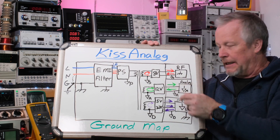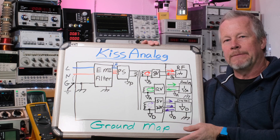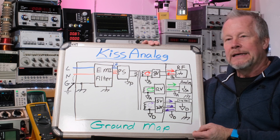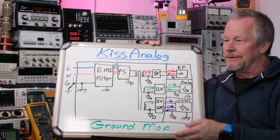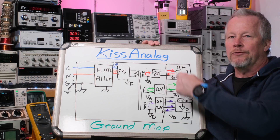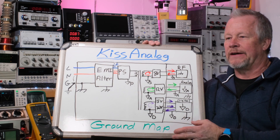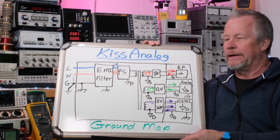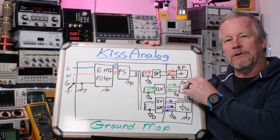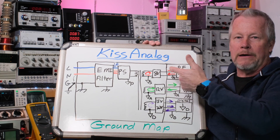If you set a temperature sensor up on the RF circuit and you're reading it down on the digital card, that line crossing over all this stuff creates considerations you have to be careful about. Temperature sensors that tie to the chassis can be problems because you're actually taking current from chassis and flowing it down so you can read it. Always be careful with any device you're connecting to chassis that has current flow in it. Electric motors, fans — it's great to have isolated power for fans and motors so you're not taking that noisy power and running it across your digital or RF stuff.